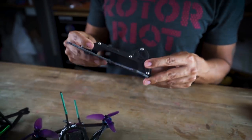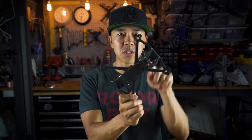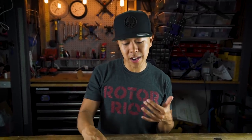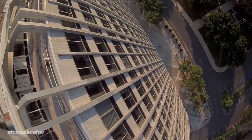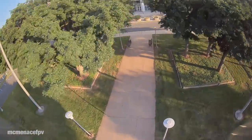This is made from 3mm plain-weave Toray carbon. Motor-to-motor distance is 164mm — that's a true X configuration. It's a little wider than typical for a three-inch, but that's the secret to it feeling and flying like a five-inch: the battery sits lower to the ground, giving more stability. All of the beta testers agreed it definitely feels and flies like a five-inch, minus the power difference.